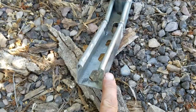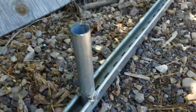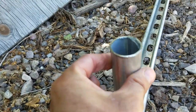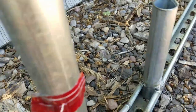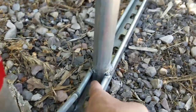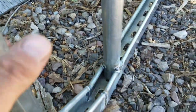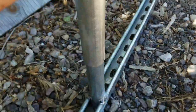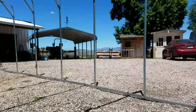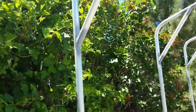We're going to put a D-ring on here. They're on a skid so he can pull the whole thing in and out if he wants. What we did here: I just notched this out with a plasma cutter and dropped these down in. This is just chain link fence top rail — it slides perfectly inside the 1¼-inch EMT. Drop that down in there, welded here and here. We did about eight inches, so after it drops in they stick out about seven inches on each side, then they go all the way down. Put the roof on and it'll be good to go.